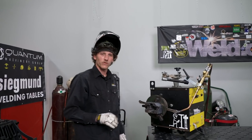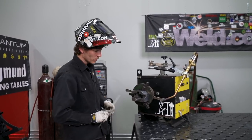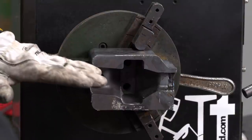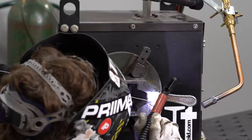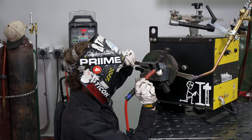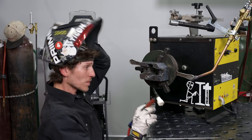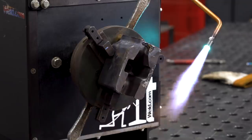I'm going to use gravity to my advantage here. I was welding vertically uphill, but on this inside section I wanted it to lay a little better, so I stopped it in the horizontal position. I'll get in there and lay a little bit in that corner and we should be good. Then we're going to cool this thing down incrementally — you can't just leave it to cool itself or else the welds can crack.